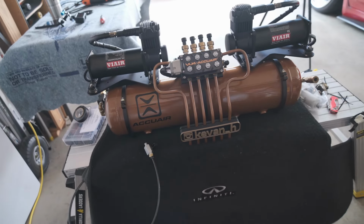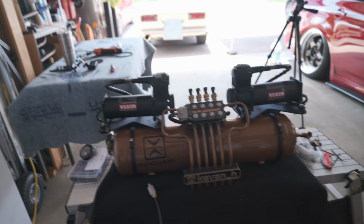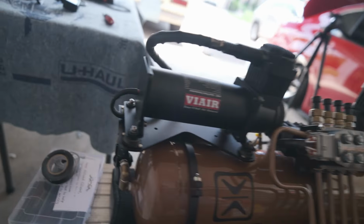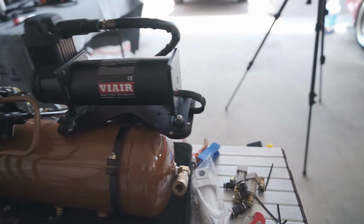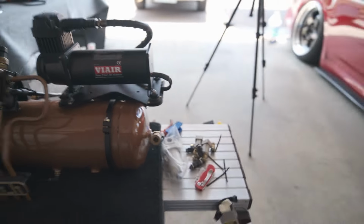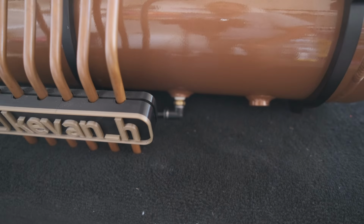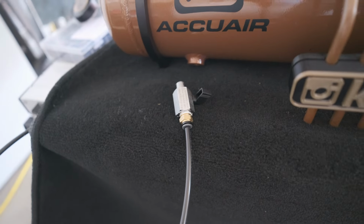So from the front side, you would see I got the secondary pump on. So now we have the two new pumps. We have our black leader hoses, which are really nice, and also our nice braided power cables, so we don't have any electrical tape anymore. I've added a 1/4 inch fit into this plug here. That was just a block off plate, and that's going to a 1/4 inch line to this 1/4 inch ball valve that's rated to 400 some PSI. So that's going to be the tank's drain.